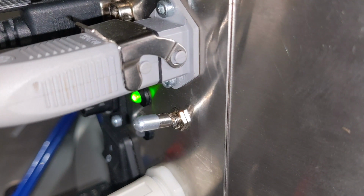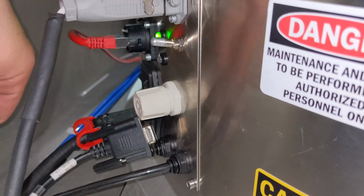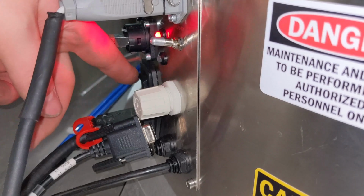This switch will define whether the Flexibowl is communicating via Ethernet or I/O. When we're setting up these parameters initially, we're doing it via a computer program, and we're going to connect that computer program via the Ethernet cable. It is also necessary that you recycle the power for control method changes to take effect.